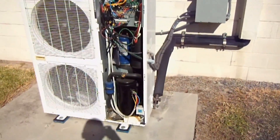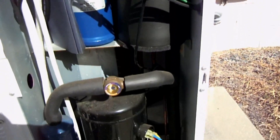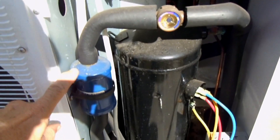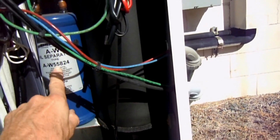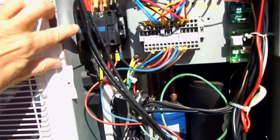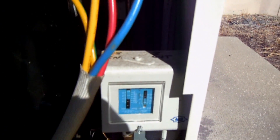Now let's take a look at the components on this condensing unit. We have your Copeland scroll compressor, and of course your liquid line filter dryer. This is an accumulator, and an oil separator. There's a contactor right there. And there's your control board. This is the low pressure control right here. Here's the defrost timer. And this is the blue board right here for troubleshooting the system.